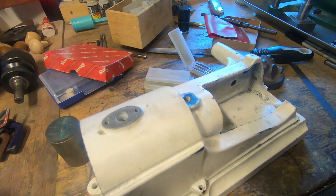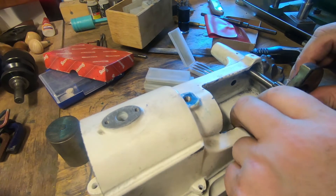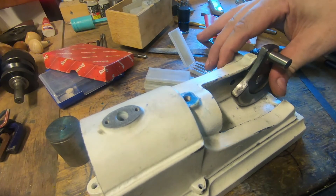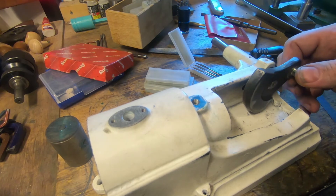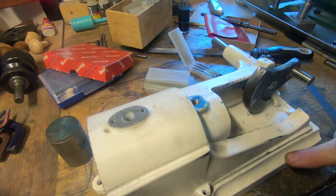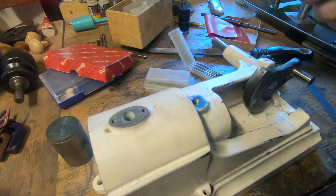So next job is to clean this up, drill and tap this, make a jig and finish the piston and make it fit in there. But we need to hone this first — I'll order a hone — and I'll turn the video off and get in here with the Dremel and the grinding wheel, and we'll have a look when we're done.